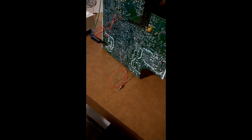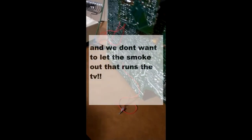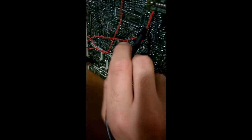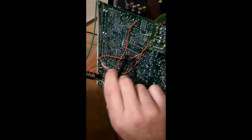These things are a pain in the arse — I'll just show you quickly so it doesn't catch you out, because it wasted a bit of my time. Generally when you're looking at a chip with the writing facing you, your indent will be on one side and your pinouts will match your description from 1 up to however many pins. On this one it's just all arse about. You've got to go off the numbers written on the PCB or you'll be working with the wrong pins. Even on the pinouts I checked, it showed that little notch and what number should be above and below it — and it was wrong. It's not even the chip we're working with; it's this one here — that'll be your jungle chip. I did try and tap into the RGB down here straight off the jungle chip, but not a chance — I could hardly see anything.